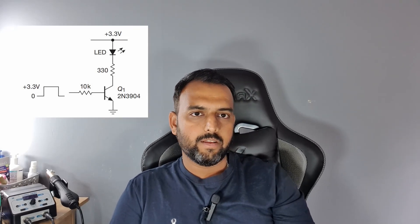The first circuit I'm going to build is this one right here, and this circuit I'm building is to test the pinout configuration for the 2N2222 transistor that I randomly bought off eBay. So I need to make sure that the pinout is going to be correct, so I'll just build up the simple LED driver circuit we did look at in question one from chapter two of the Art of Electronics.